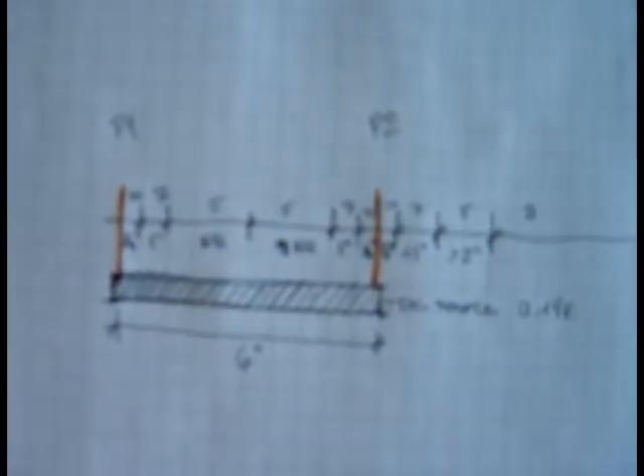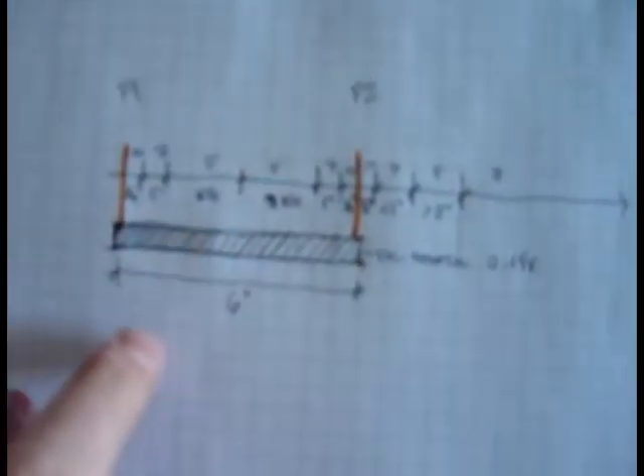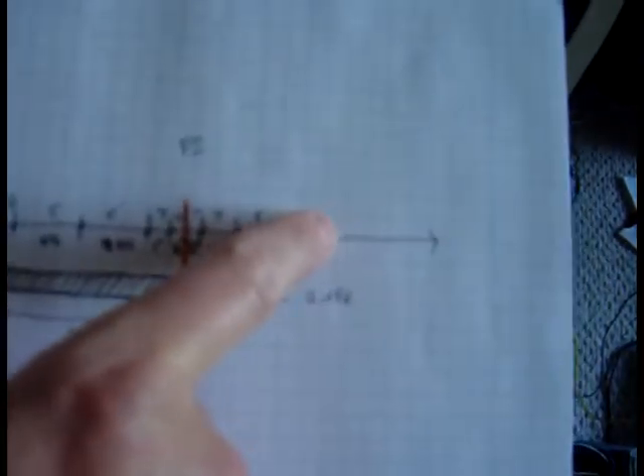I have the board here. Pin 1, pin 2, and I'm getting a pretty good reading. About a quarter of an inch away I'm reading 10, then it drops to 7, then to 5 — again, arbitrary units. Midway between the board — the pins are 6 inches apart — it climbs back up to 10 near P2, then drops off on the outside of the pair down to 2 at about 3.5 inches away. Pin 4 is proving to be a little more stable, around 7 near each node, dropping to 2 in the middle and 0 outside pretty quickly.